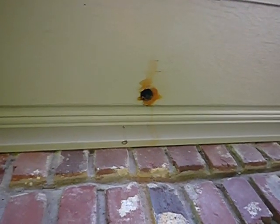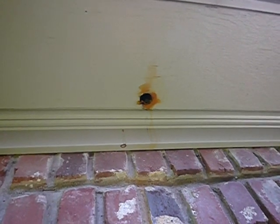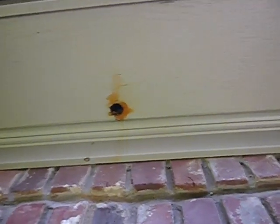This little rusty dot right here — that is presumed to be your secondary drain line, your emergency drain line for the air conditioning system. Obviously we had rusty water coming through here, but you'll also notice that the pipe does not extend through the soffit. Then we come over here, we've got some water damage on the soffit. Is that water damage related to the rusty water? It's supposed to discharge over a window so that when you look out the window, you see that you've got a problem. And then we have this big rusty stain here where we've had a problem.